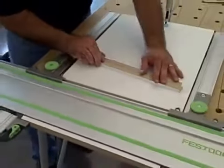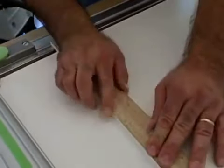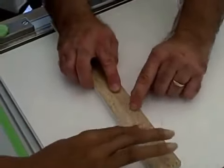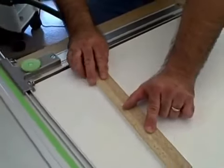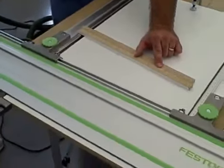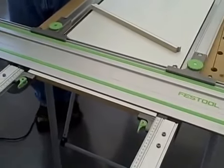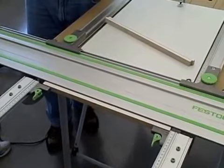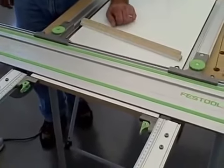Let's see this piece here. Now come over here and feel this — look how perfect that is. It's absolutely perfect. Isn't that neat? That's how it works. And it's like that every single cut. Now I've compensated by calibrating 2.2 for the kerf of the blade — every blade — and I get a perfect cut. That's how that works.